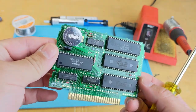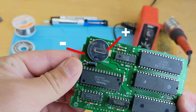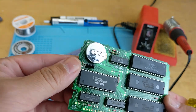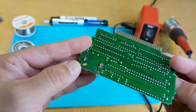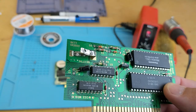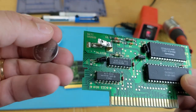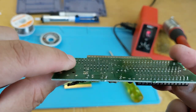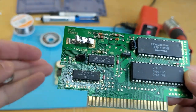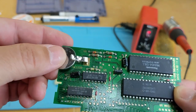Once you get the cartridge apart, note the top of the battery with the writing on it — this is the positive side. Either snap a pic with your phone or write a little plus on the circuit board with a Sharpie; you don't want to mix that up later. You might be considering just snipping out the old one and soldering a new one right in — don't do it. The heat from the soldering iron can damage lithium batteries, and excessive heat and lithium do not mix.